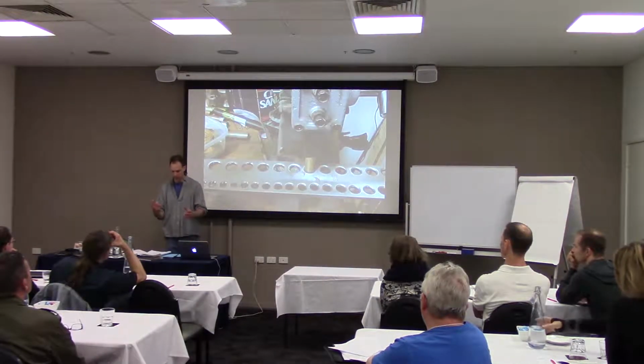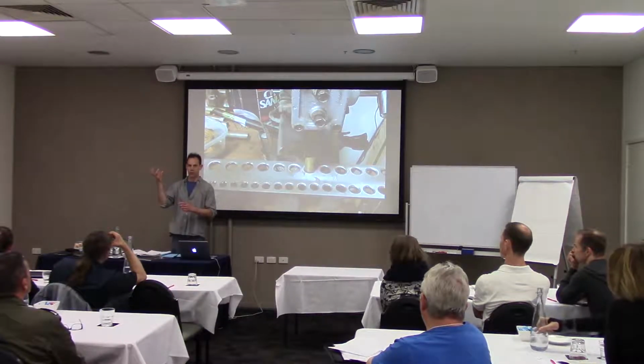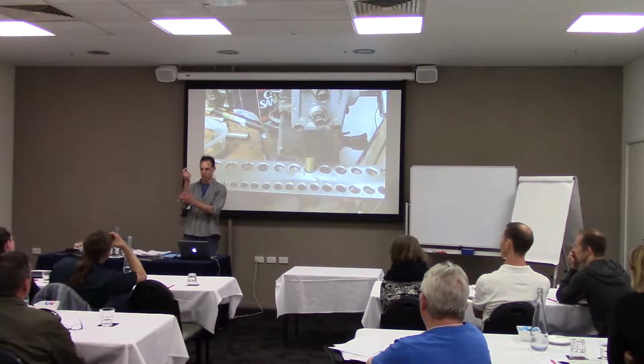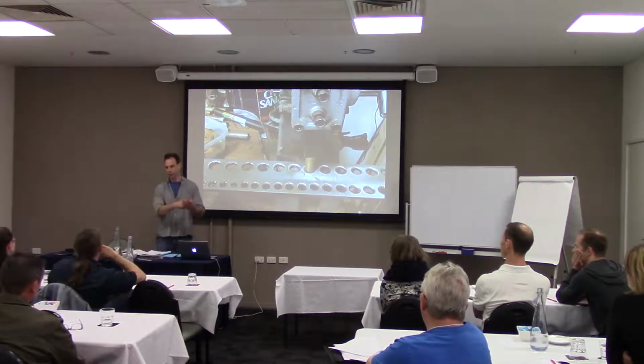Lawson had a cool one. It was a hydraulic, so it would force through as opposed to pulling. He had like a 2-story shop, and he had a hole in the floor, and these long lead pipe mandrels would go up through the floor, and he would drive it up, and whoosh, there was this lead pipe that was super long, and it was really cool. And he had all these different theories of different tapers affecting, for whatever purpose, and he was a master at that. But similar way, and then Shires, they'll do that too. They drive through the mandrel.